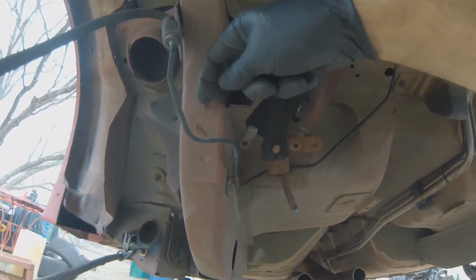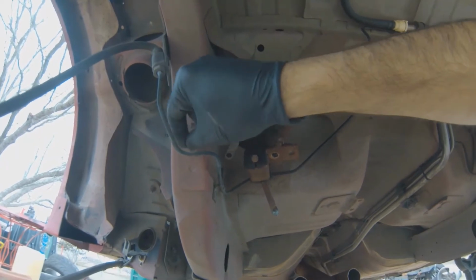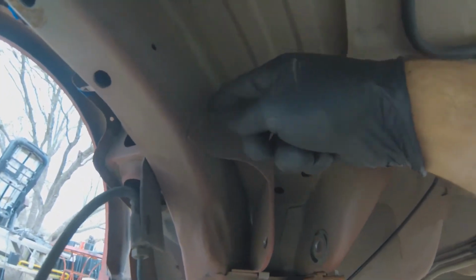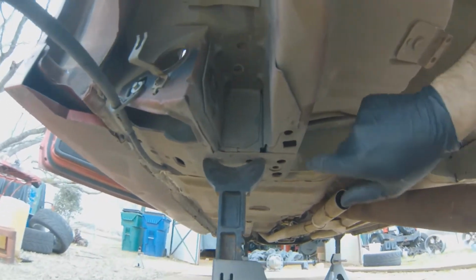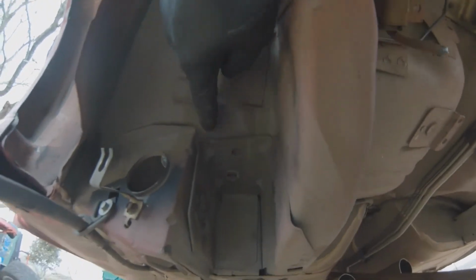You can see the spot welds, and this stuff is sharp, so you can get in there with the grinder and clean that up with a flat disc. Clean up some of them sharp spot welded areas, and then stitch weld that. And then you have this one for the lower control arm. Pretty much the same thing. Get in here and just weld up wherever you can.